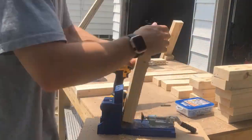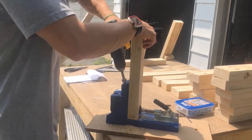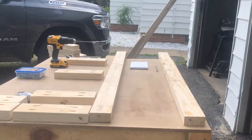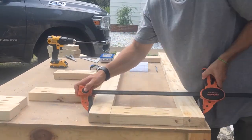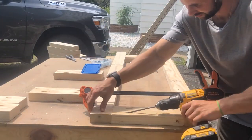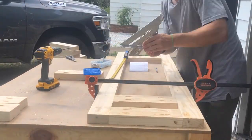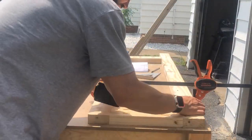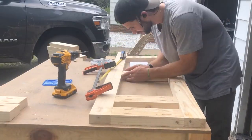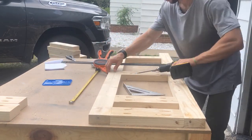Leading into this, you're going to start to construct the different legs. We're going to start by assembling the tall ladder, which is what you'll see me doing here. It's really just ensuring that each section is level and square, then going ahead and putting in those 2.5-inch pocket hole screws — four on each cross section piece — making sure everything is clamped down, flush, and square.